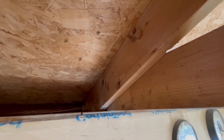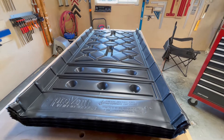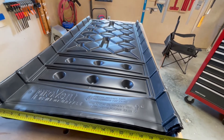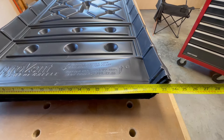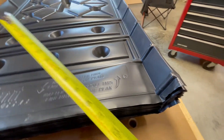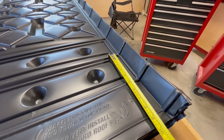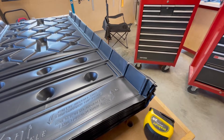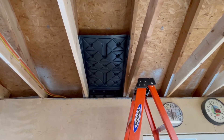Back on the ground — these baffles are 23 inches wide and we know they can't fit up there as-is. I measured the distance I have to work with up there: 20 and three-quarter inches. So I'll have to cut some off, and then do some measuring to find out how far up I'll need to notch across and cut a section out. Let me go measure and then we'll cut one up and see what it looks like.